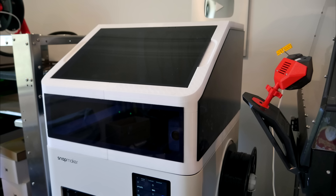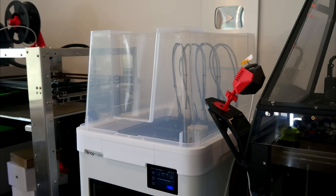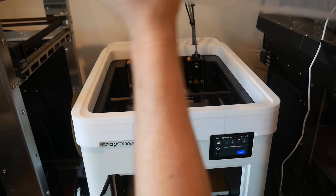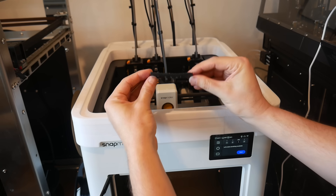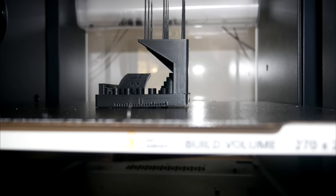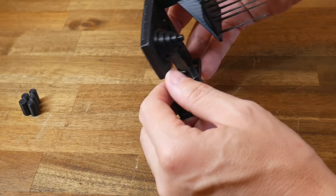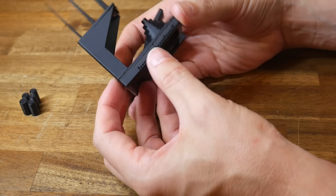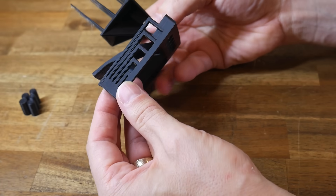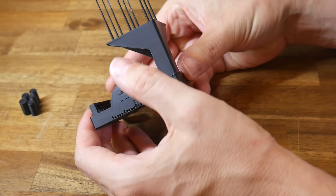I think this is partially explained by it being later in the day and therefore slightly warmer, but also because the IKEA tub appears to have a larger volume and uses thinner plastic. You might recall me mentioning in my first video that the bed is not super sticky if you're not using PLA — I verified that during this testing, having to cancel the first print because the ASA didn't really want to stick at all. The model did stick at first but was quite warped. For the second test I put on a lot of hairspray, but even so, this bed is just not suited for these filaments — the model came loose and peeled up, just about holding on until it finished. This print is completely untuned, so overall it looks pretty good. Those lumps on the side walls will disappear once the model remains stuck to a proper bed. So for me, these cheap top lids are definitely worth it — you just need a suitable bed to make the most of the modification.